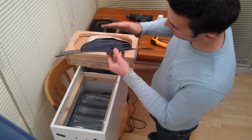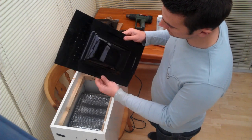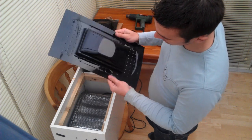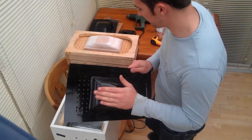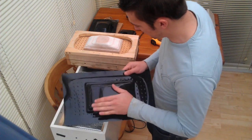So there you go. That's quite a lot of draft — we've pulled about three inches on that mould and the definition around all the corners is pretty good. I'd be quite happy with that. I've slightly overheated it, but trying to do it on camera has put some pressure on.